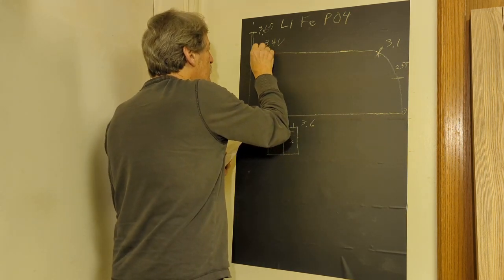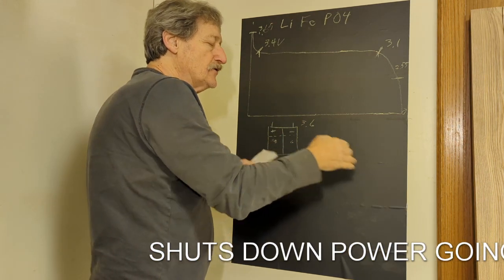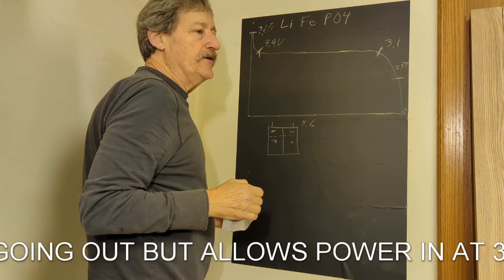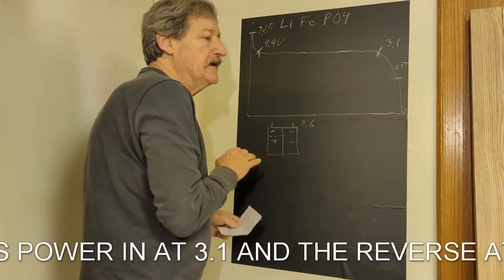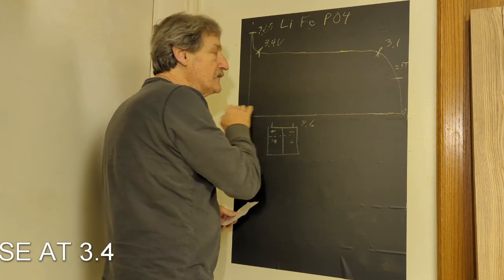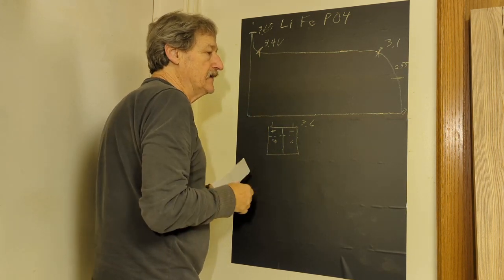When you have your input from your solar panel, your BMS will tell you what each cell should go up to, and you will tell it to go up to 3.4 volts each cell, down to 3.1. At 3.1, your BMS is going to shut it down. When one cell goes to 3.1, everything shuts down, so you don't damage your battery. And when one cell gets up to 3.4 volts, it shuts down. The BMS is supposed to try and even them all up, so if one of them is slightly higher over time, it'll repair that and they'll all go up to 3.4.